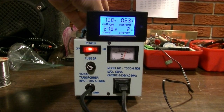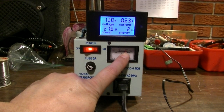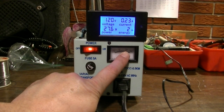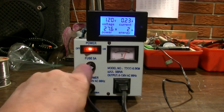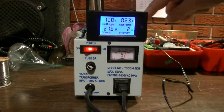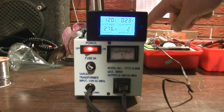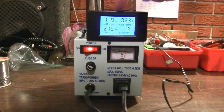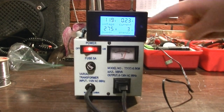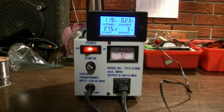And there's our 120 volt mark. We'll notice down here this one's reading 110 volts or so - just over 110 volts - so that's obviously not an accurate meter. It's also worth noting that the little mark that I've made on my Variac is accurate according to this as well - it's dead on. So this I believe is just as accurate as my Fluke as far as voltage is concerned. That's how you modify one of these cheap Chinese Variacs with one of these cheap Chinese displays.